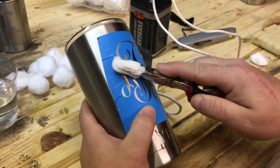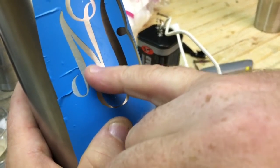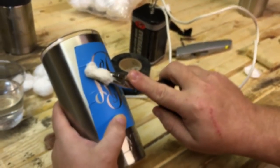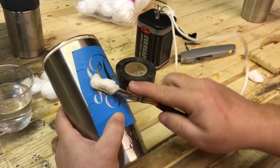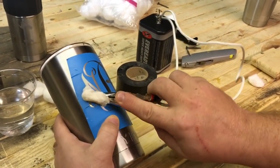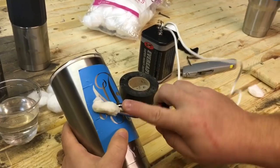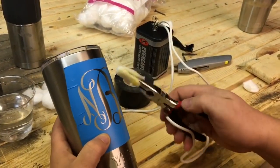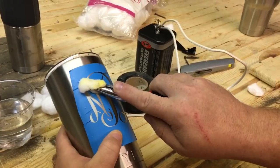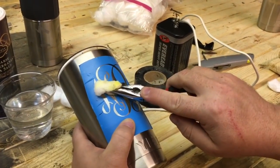As I do it, I'm going to just roll it in, leave it there for a couple of seconds, move down, and just keep rolling. If you look close, it's starting to eat away at the material. That yellow color is the stainless steel coming out. This will take about 20-30 minutes — you have to be very consistent in how you lay out the cotton ball. If you listen closely, you'll hear it start to sizzle — that's the electricity turning the water into vapor. Sounds a little like bacon frying.